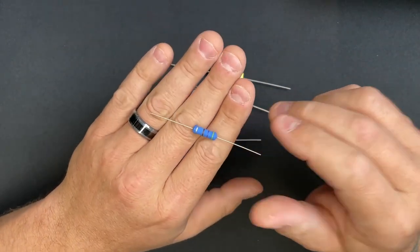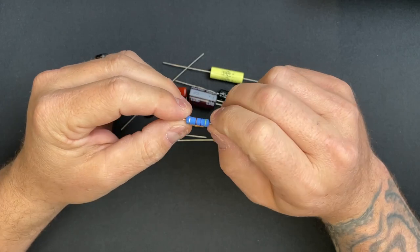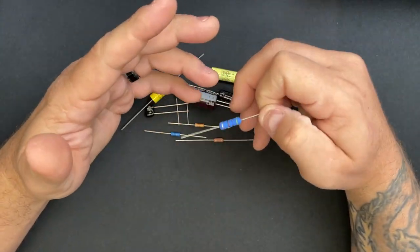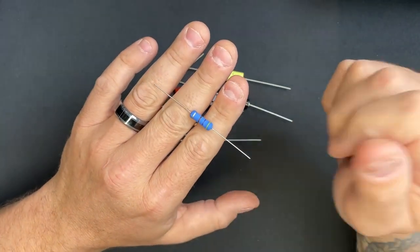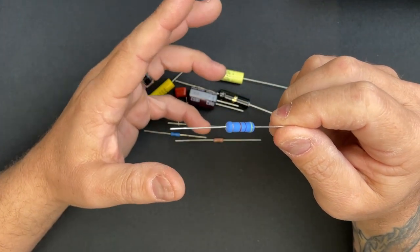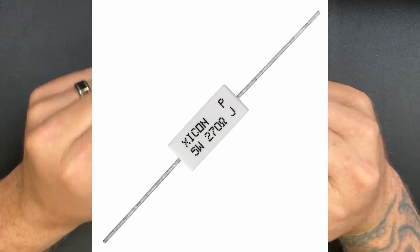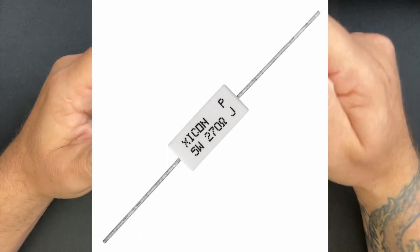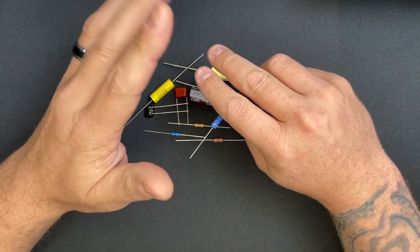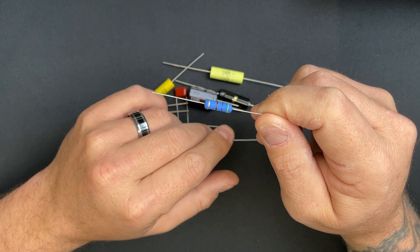There are a couple of other resistor types. This metal oxide resistor is used in the power section — it's coated with a ceramic coating, so it doesn't go up in flames; it just cracks apart. For posterity, those big white brick resistors you see are generally lower value but higher wattage — roughly 10 ohms up to 10 to 20K. They don't get much higher than that generally.